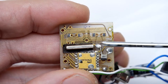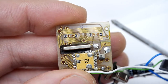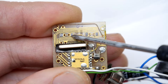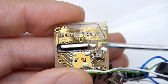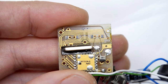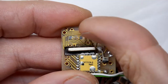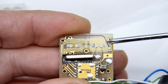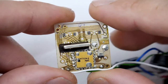It'll go from digit to digit, multiplexing and changing the pattern to give you each digit — one, two, three — and it zooms around like that, and that's how you get your display. These are actually bonded to the IC — you can see the common parts of these little integrated LED circuits, and these are the data lines effectively. You can see how these would have been bonded with little tiny wires from here to here, and that's what you get underneath those black blob chips. And that's essentially it. So when you go in and you destroy these micro wires, which are often made of gold or some sort of precious metal, you're basically scuppered — how do you solder anything back?